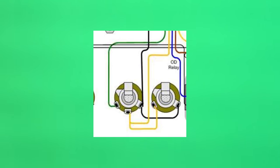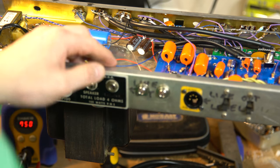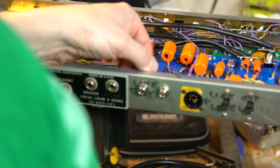I can find a fairly short lead for this very short jumper. I'll stop recording for a minute. Back now — the effects loop is wired in. I wasn't going to show everything since it's straightforward wiring. Both jacks are done, and I ran a grounding wire from the ground jumper straight over into this preamp ground clear in the corner. Those two are now wired in and done.